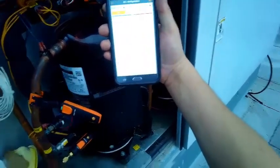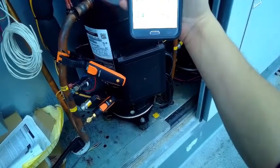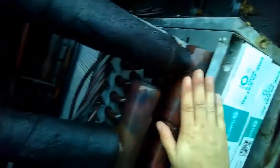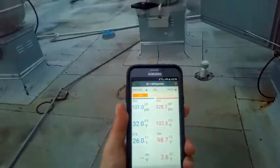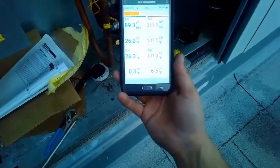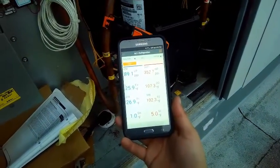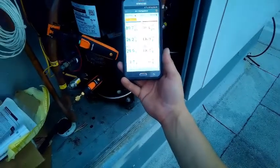So this is what you get with unloading and loading. It's going to shoot down to zero when it unloads. So what it does, takes that head pressure off, squirts it back into the system there. I bet you it's still going to freeze up. I mean, it's way, way too cold, man. Wow. Let's see, what temperature I got on my... Yeah, there you go. Evaporator temperature is 27.2 degrees. 26 degrees. I mean, again, there's nothing I can really do with this, but you guys wanted to see one of these babies in action with gauges on it. Well, here you go. All right, there it goes.